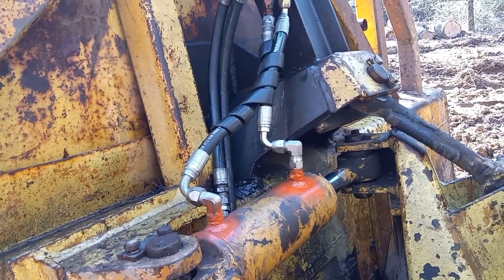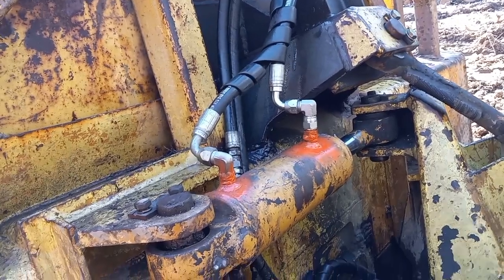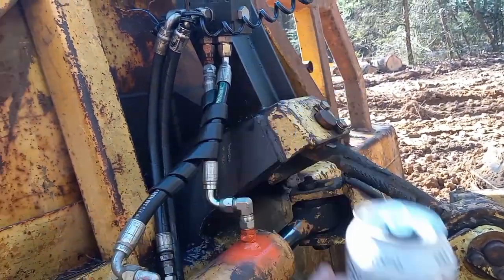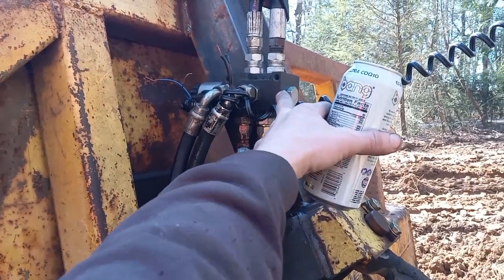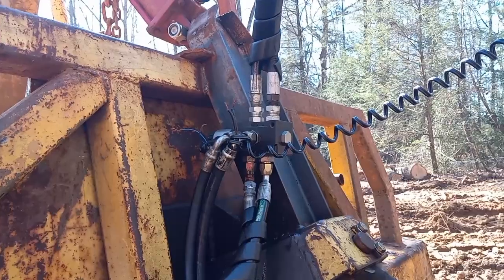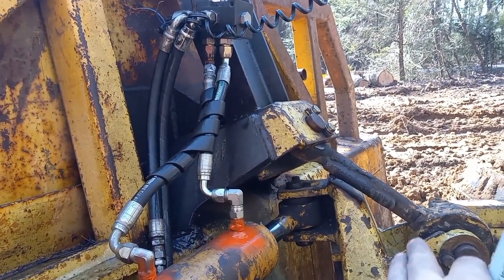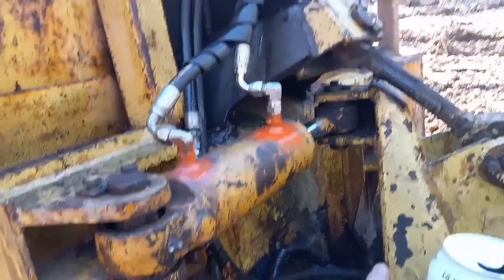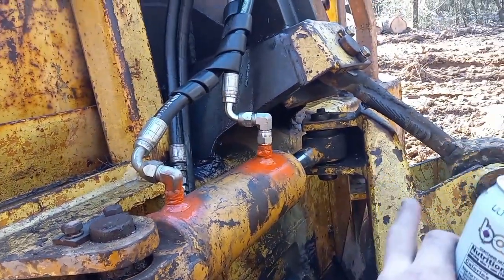There's a lot of chaos that goes on in there that I can't see, so having the hoses tucked up real tight seemed like a good idea. When I jumped in to leak test it, my welds were fine — no leaks — but the blade angled the wrong way. I tried to swap some things around up there but there was no chance, so I just swapped those two feed fittings into the DC selector valve. The only thing now is that the grapple is going to open and close backwards, but I'm not even accustomed to which way it opens and closes. The blade has to go — if you move the stick to the right, the right-hand corner needs to dive down. That's a six-way, and when you're cutting a grade by the seat of your pants it needs to happen fast. That's another reason I went up on hose size and port size, so that angle cylinder could respond faster even at a lower RPM.